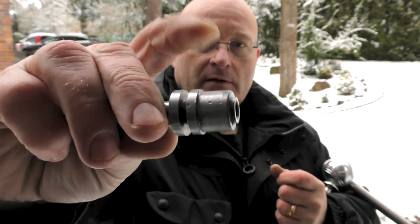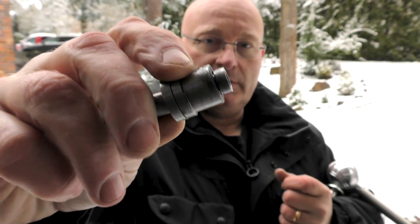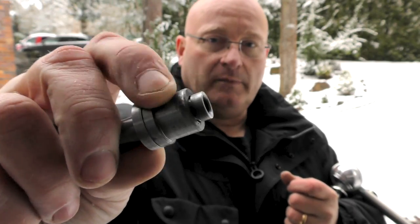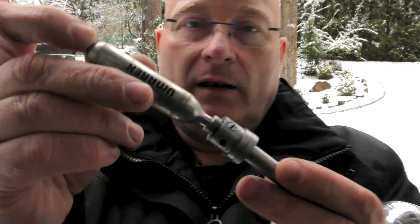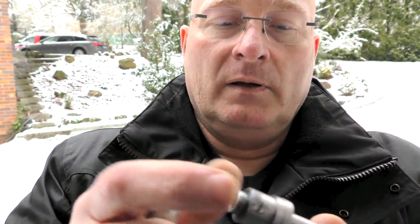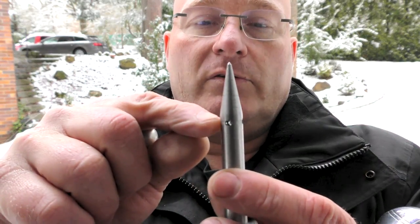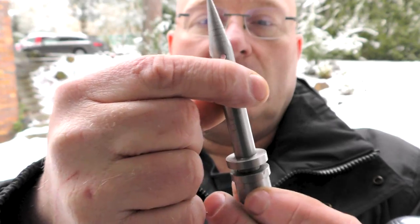Here you can see the inside — this is the moving part. There is a set screw that holds it in place and makes sure it's not falling out. And inside here, there is a little piercer. It is important that the CO2 cartridge gets centered really, really well, because otherwise it would not pierce the little hole in the middle. The spike is hollow and the hole leads to four exit holes.